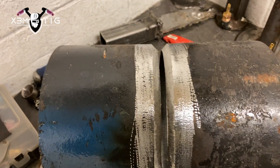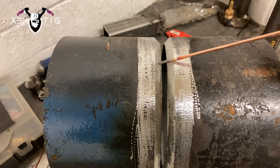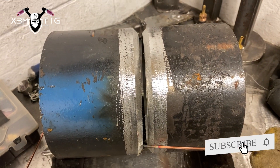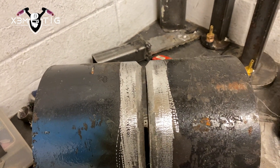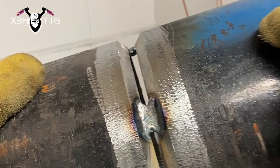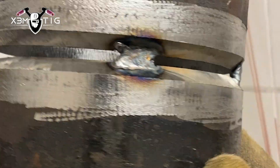As long as they want it, wiggle all the way around. For the tacks, I'm going to do one root tack at 12 o'clock on the top and I'm going to do two bridge tacks on the sides — this is a little demo of a bridge tack, nothing fancy, just to hold those two pieces together. One root tack at 12 o'clock and two bridge tacks on the side at 3 and 9 o'clock.